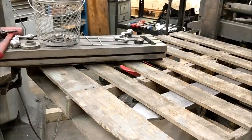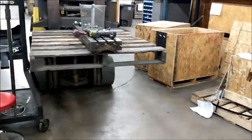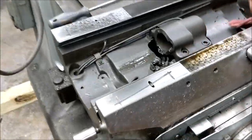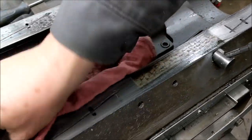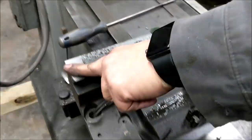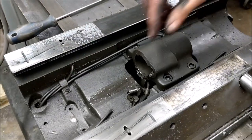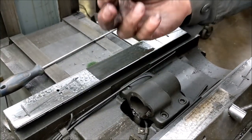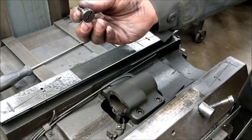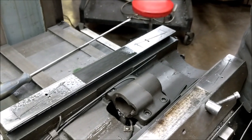You can see plenty of wear — originally this thing had flaking the whole way. The front is gone completely, the back is gone on the outside edges. So this thing not only has worn on each edge, it was also wearing towards the front. There's the screw we took out of the feed nut bracket — this was being used as a locking screw, which is not correct, so it will just get thrown away.